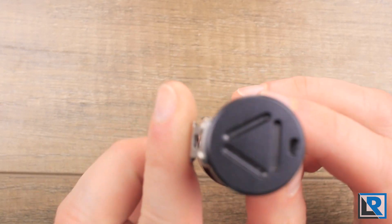JetBeam includes a branded 700 milliamp hour 16340 battery with recharging built in via micro USB. Charging speed was 0.4 amps, which is appropriate for these small capacity batteries, and it took right at two hours to charge completely. The LED indicators go from red when charging to green when charged. The light also takes 18350 batteries which fill the cavity better. Using a protected 18350 might mean it doesn't screw down completely flush, but this doesn't harm the IPX8 water resistance.